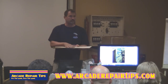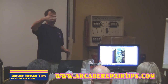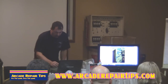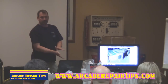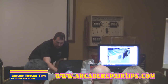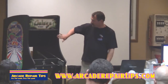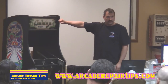The glue starts peeling like an onion after 30 years. I've got to figure out: do I need to re-laminate the whole front, or can I take part of it? That's basically what happens with Miss Pac-Man and Pac-Man — you get about an inch to two inches on the bottom that just starts to peel off. So this is the process where I'm stripping down the cabinet to assess the damage. I also take the T-molding off, because nine times out of ten it's just worn — not shiny. That's another good assessment of what's going on.